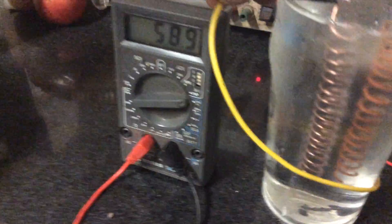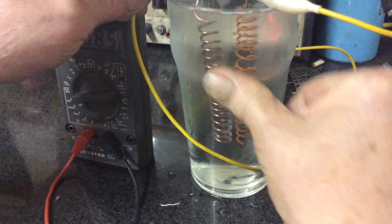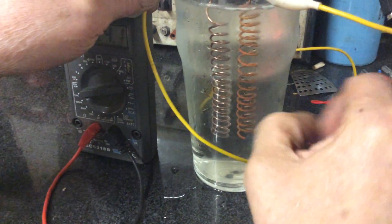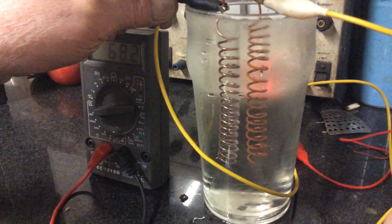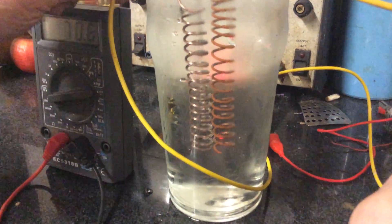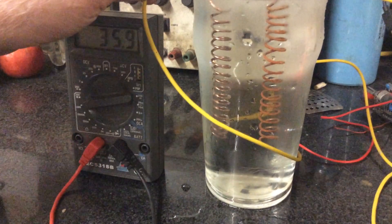You can see hydrogen forming — sadly the water is very cold here. We've got condensation forming on there. I'm pushing a current of about 67 milliamps. Can you confirm there's gas forming? I can't see — I'm not close enough. Coming back to about an inch of separation, about 25 millimeters, we're at about 36 milliamps.